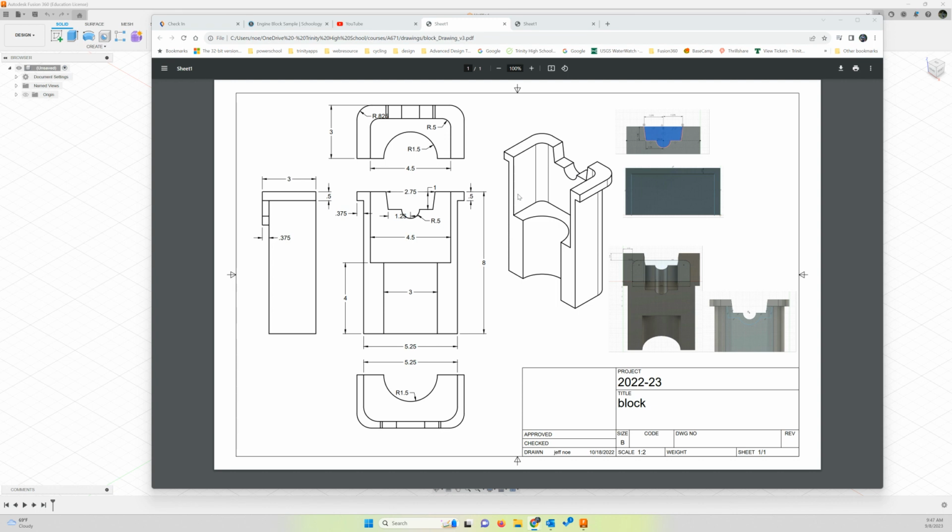My approach to this is very different. I build the base block. So for this block, we've got 3/8 overhang here, 3/8 on this side. That's 3/4 together, added to the 5¼ base here. I designed a block that's 6 inches by 3 inches, extruded up the full 8 inches, and then start cutting away the material to make the cutout portions in it.